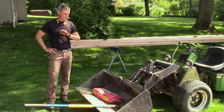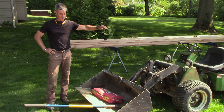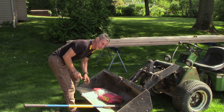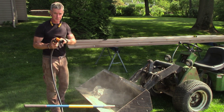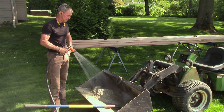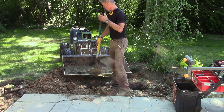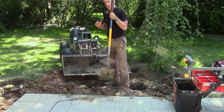The holes are dug, I checked layout and we're running perfectly along the line. Next, concrete — a couple pro tips. One: the bag, you don't have to go to war to get it open. About 22 seconds on shower with this nozzle is exactly the right amount of water I need. Half a bag of quick set concrete in each hole, let it cure.